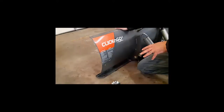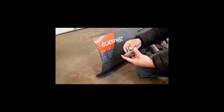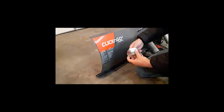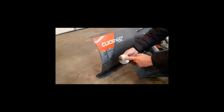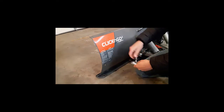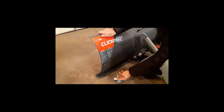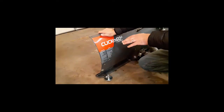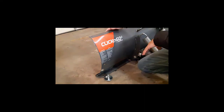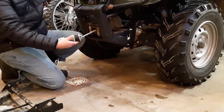When you want to do your gravel driveway you will want to put your skid shoes on. You get a set that comes with your blade, but after much use they wear out and fall apart, so you just order yourself a couple new ones. When putting on your skid shoe, you adjust it to how high you want your plow blade off of your driveway.